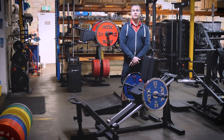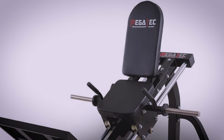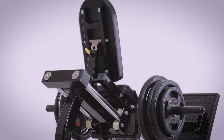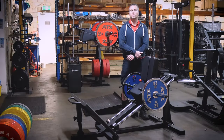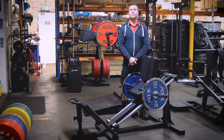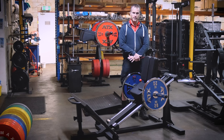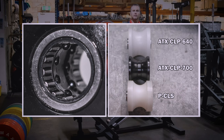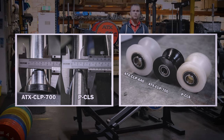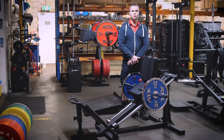The big step forward came around 2008 when Powertech started using a thicker roller that solved these issues. ATX previously used to distribute Powertech in Europe. They had a falling out and ATX made the Megatech range. The Megatech CLP350 introduced thicker guide rails and further revised rollers. However, the rollers on the CLP700 are a completely new design made from a much more durable material — the same as featured on the BPR790. They now feature both roller and needle bearings, rotating on a bush sleeve versus just a bolt. These incremental improvements keep stacking up, and the movement on this machine is the smoothest ever.